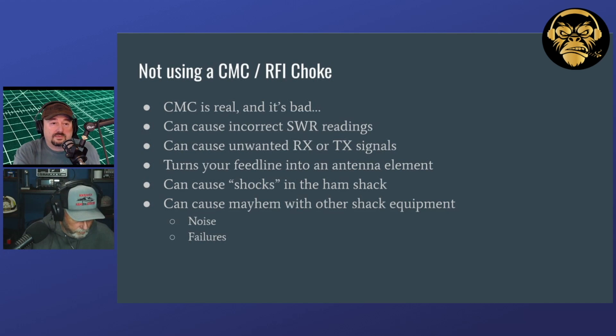When you think about the transmission of a signal from an amateur radio, it is using AC current or differential mode current, which is equal and opposing. You have a certain amount of current going out and a certain amount coming back in. We use things like a balun choke, which will let that pass because it's going in different directions — it's not causing a problem. In a balun choke, if you have extra current on one side, either in or out, and that switches back and forth, the choke introduces a level of impedance which really just chokes that out and stops it from passing through.